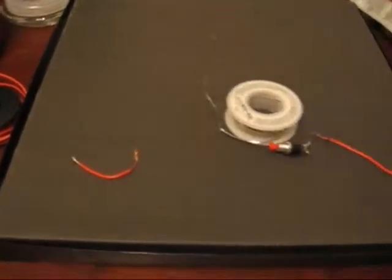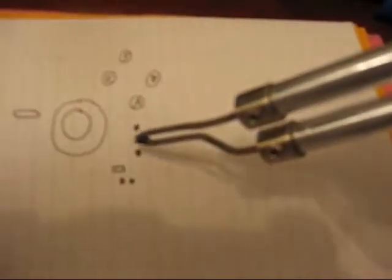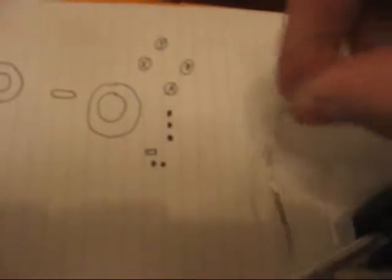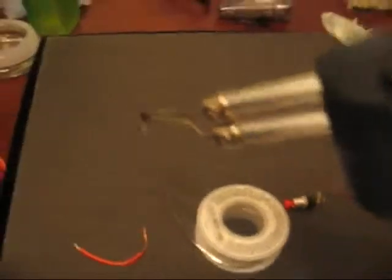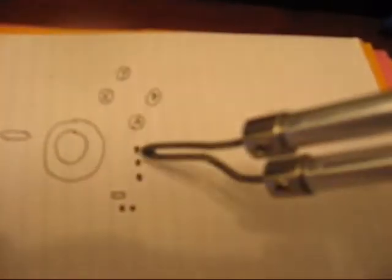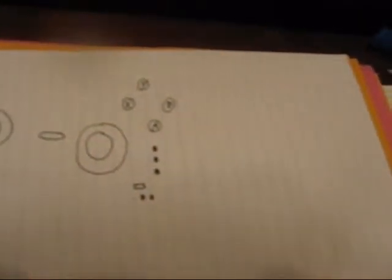Steady Man is where you have the soldering gun on the part that you want to solder, and then while you're holding it there, you put the wire on it. That's a horrible idea, because you'll hit both ends together. So just get your iron hot, tap it on top here until it starts melting on there, and then just dab it. You don't need much, and then as soon as you're done dabbing it, stop, let it cool, and it'll harden. You can do that on both, obviously.